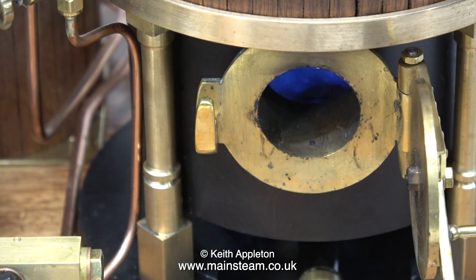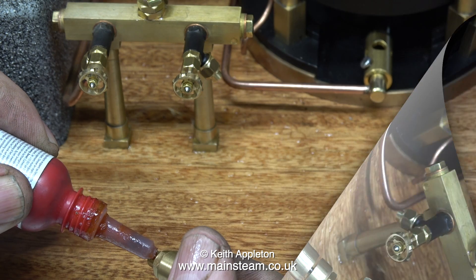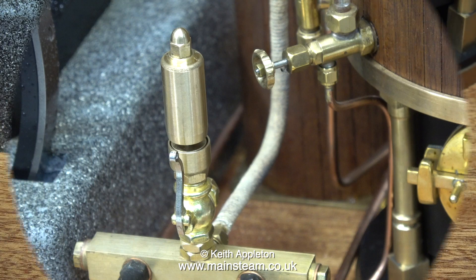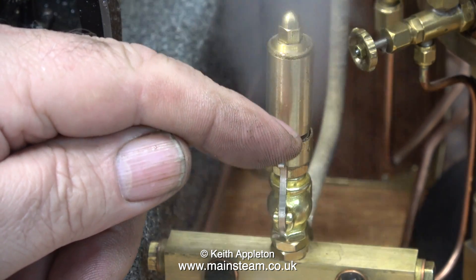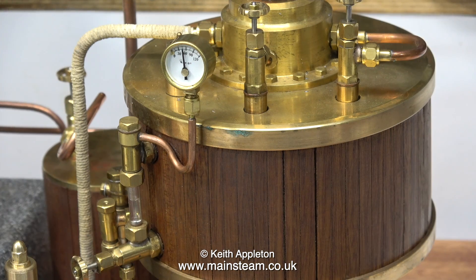Time to relight the boiler. A while back, I bought this from Microcosm, and this is a bell whistle. It has its own steam valve, but the thread is a little bit too big to fit into the turret, and that's why I used the valve from the first siren. The reason why the bell whistle isn't blowing at the moment is because the boiler's nearly at working pressure, which is too high for the current physical setting, so I adjusted that.